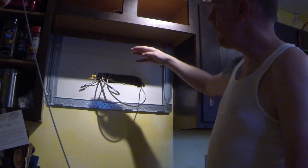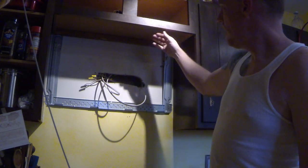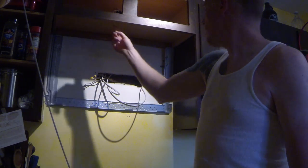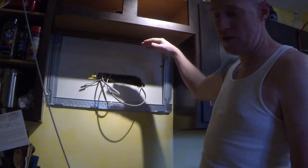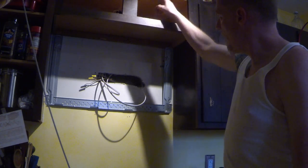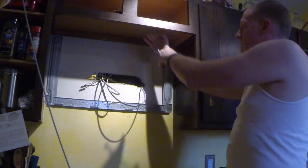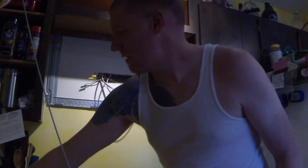The top of the microwave is going to mount to this. They show three different sets of instructions: one for solid bottom, one for with a recessed shelf like this one — which has got sides on all four edges — and one with just a lower front lip from the bottom of the shelf. With this particular model, I'm actually going to have to cut some blocks of wood and mount here. These really long screws are going to go through here, through the block of wood, and mount to the microwave, which is going to sit flush against the bottom.